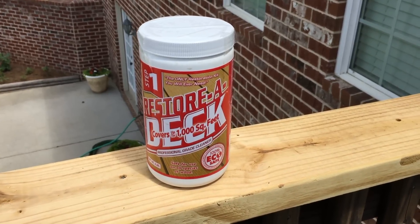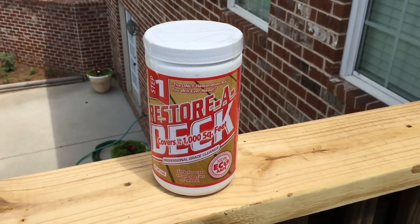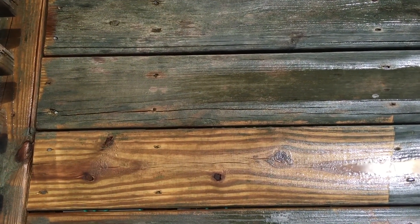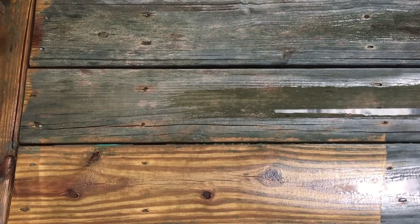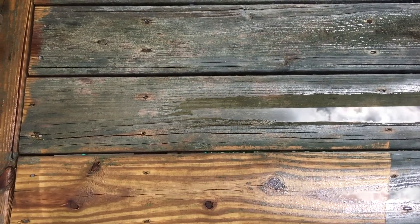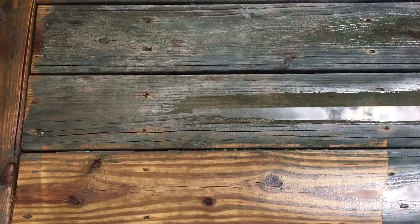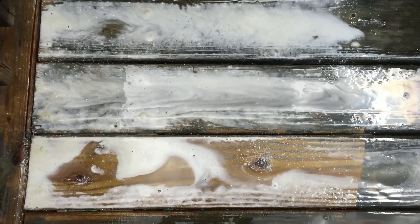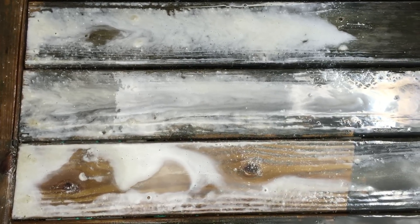I purchased this Restore-a-Deck cleaner and while I was pressure washing my deck it made me think that I should do an experiment to see if pressure washing is necessary before using the Restore-a-Deck cleaner. So what I've done is pressure washed one board all the way down to the wood, which people say removes some of the soft wood and may leave ridges. The board above had one light pass with the pressure washer, and the board above that was just wet — no pressure washer, no cleaning at all. I'm going to put the Restore-a-Deck cleaner on there, let it sit for 15 minutes like it says, and scrub each board with 10 strokes. You can see the cleaner foams up a lot, and I'm assuming that means it's oxidizing and that's how it cleans the wood. We'll give this another 10 minutes and check on it.